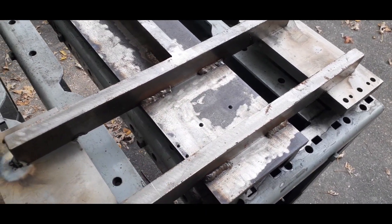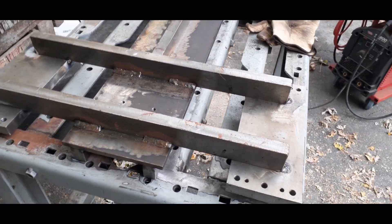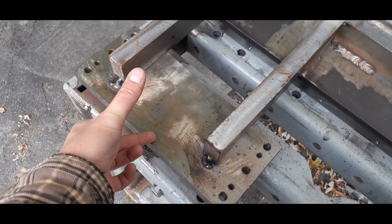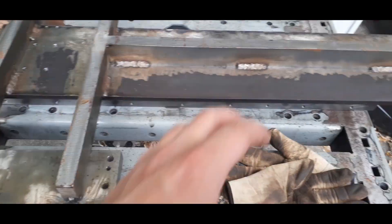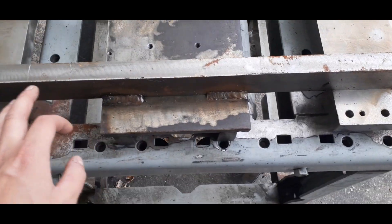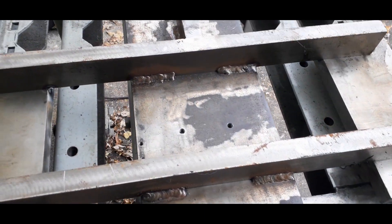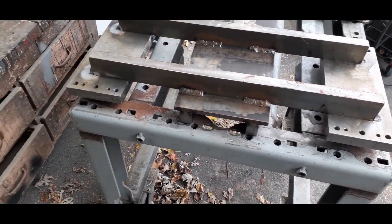This is the structure of the base of the CNC mill — it'll still be cast within a casting using a precision non-shrink grout, like Sika 212 mix, with some coarser three-quarter-inch and smaller angular aggregate, about five to six inches deep from the depth of this member. You can see the internal ribbing — the main stiffener down the length of the mill — so this will be the Y-axis, and then two parallel one-inch by two-inch flat bars, cold rolled. With cold rolled you get a much squarer edge and flatter surface compared to hot rolled, so there's less lapping and precision work afterwards.